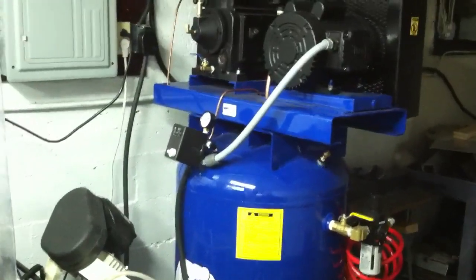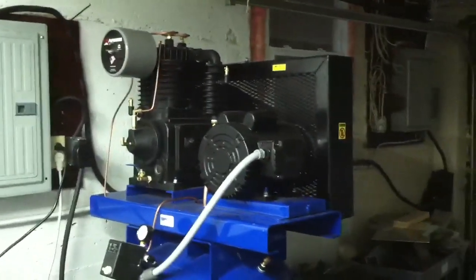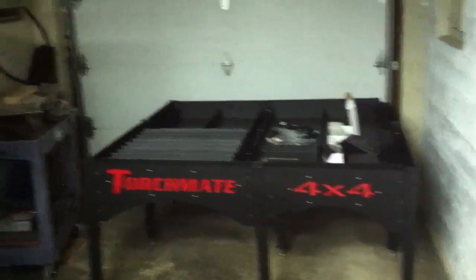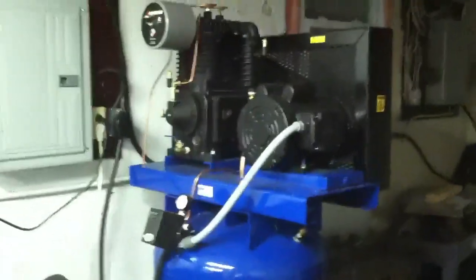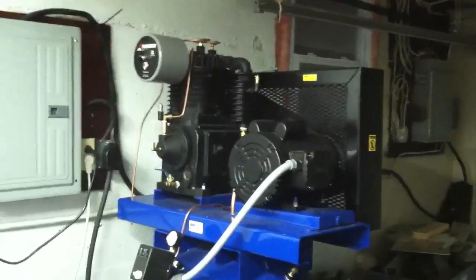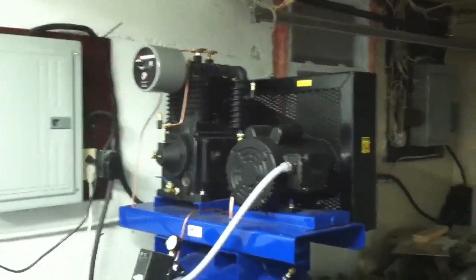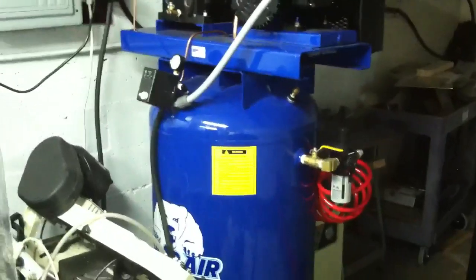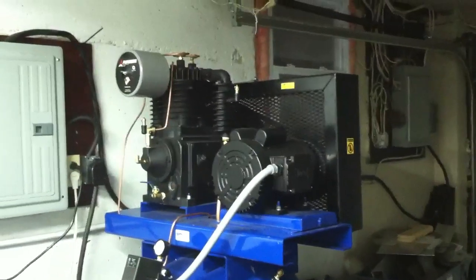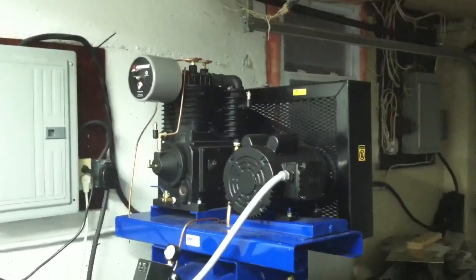I think this was delivered for around $1,700 — I'd have to check that but I think so. Some people have said, is that too big a compressor for what you're trying to run? The reality is no one's ever bought too big of a compressor. The two smaller versions would either be an 80-gallon tank with a single-stage head or a two-stage head with a 60-gallon tank, and neither of those downsizing options made sense to me, especially since they're not that much cheaper.